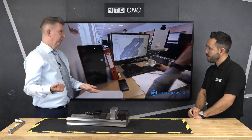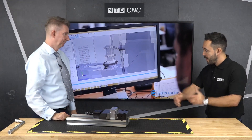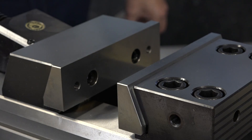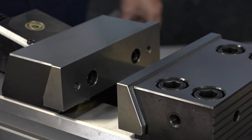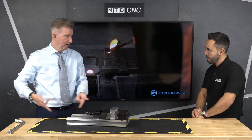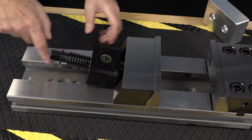And what kind of clamping force are you looking to get? By using the torque wrench you get optimum clamping force. Capacity — we do these in eight different sizes, which means you can go from a 100mm jaw width up to 200mm, and capacity-wise from naught up to 360mm.